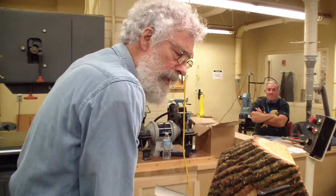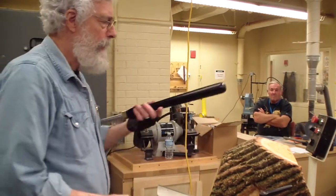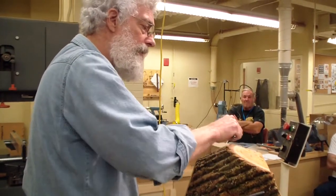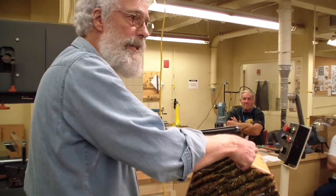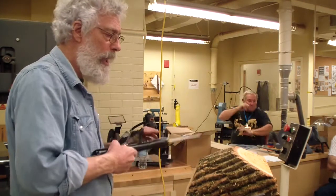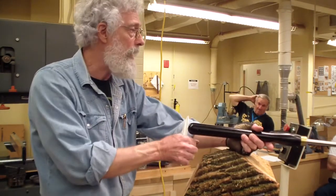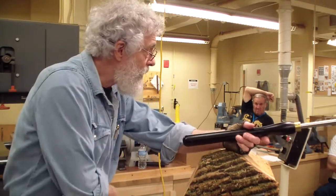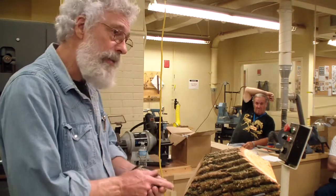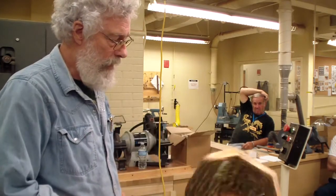And I can show you a perfect example for those of you who are just kind of getting started in turning. If I take this stick, think of yourself as a kid, and I start working down that surface like that, it's perfect. It works nicely. The moment I come back this direction, the blade gets stuck in the wood, and that's exactly what's going on here. In this case, the handle's pointing at me. If I come this direction, everything works nice. If I go that direction, I get stuck in the wood. The nice thing about wood itself, however, is that wood tells you which way it doesn't like. So if you're going in at this direction here and it's whacking around at you, simply turn around and go the other way, and it'll be very, very kind to you.